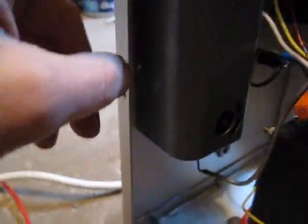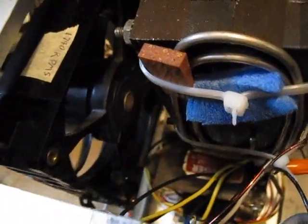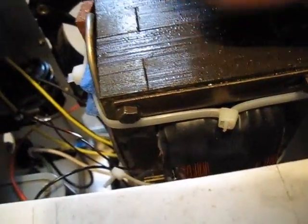I find the upper transformer gets a little warm, so I hooked up a thermostat here. I've just got it temporarily held in place and might secure it better in the future. When it gets to a certain temperature, it will kick the fan on and provide additional cooling, most likely when under heavier loads. I don't want this burning out because rewinding these transformers took the better part of a week — there are about 20 wires coming out of each transformer. I left the primary windings intact; they were already wound for 120 volts AC and I didn't need to touch them.